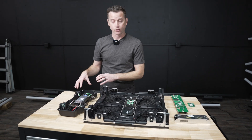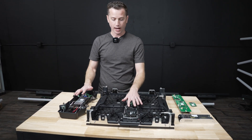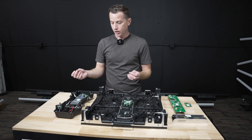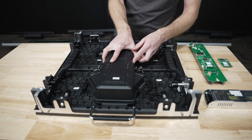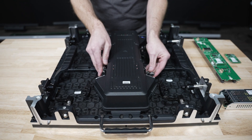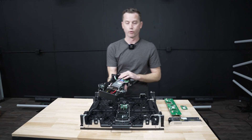You can see there's very little cable within this when compared to other units. The magic here is these direct points of contact that provide power and data without any use of cable. To attach the cabinet, which is going to provide power and data, we're going to just align the pins, give it a push, and lock it to the cabinet. It's that simple to service the back of the Apex panel. To take it off, I would simply just unlock and pull it right off.